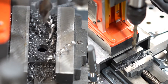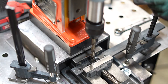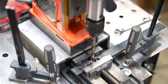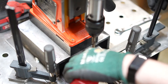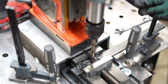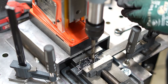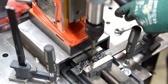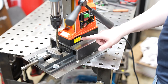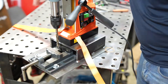Now let's talk about safety for a second. Aside from the usual dangers of a drill press, there are a couple additional dangers with a mag drill. The magnet can fail due to a number of variables: if the material is too thin, if you're applying too much pressure, if somebody trips over your extension cord, if your power goes out, etc. This is especially dangerous if you're drilling in the horizontal or vertical positions. VIVOR included a lashing strap, but it's not entirely practical for this stand I'm making.